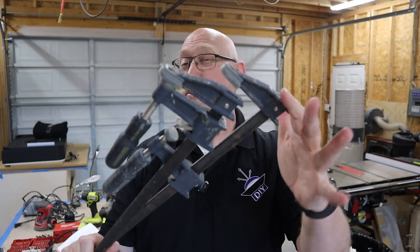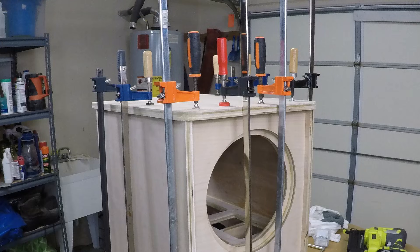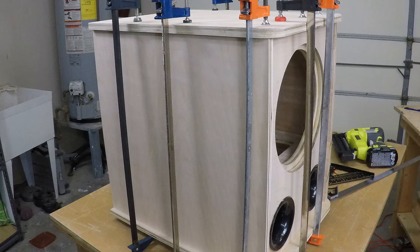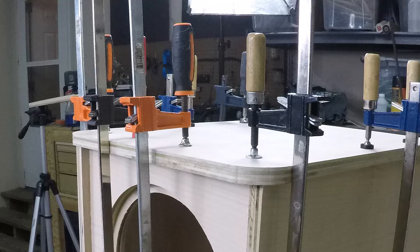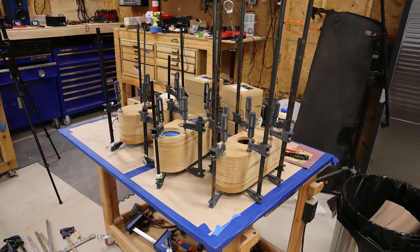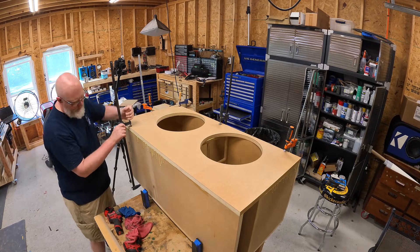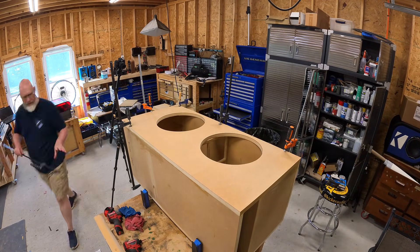The other thing you need to go with the rip cut is a piece of foam insulation. You just lay the foam down, lay a whole sheet of plywood on top of it, and then grab the rip cut and start ripping. Clamps are important — you don't have to have them, but they will make your life easier. I use clamps as extra hands. Buy them as you can afford them; wait for them to go on sale. A woodworking friend told me to only get 36-inch clamps, but what I've learned is that for small projects you've got big clamps in the way. Shorter ones do just as fine and they're a little bit cheaper. Wood glue might be the most important part — it's literally the glue that holds things together. If you have straight cuts, wood glue is all you need to seal the seams.